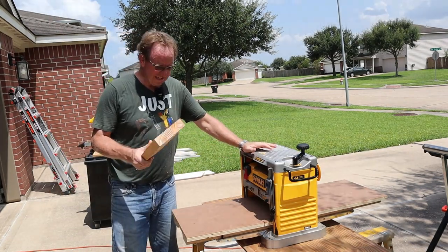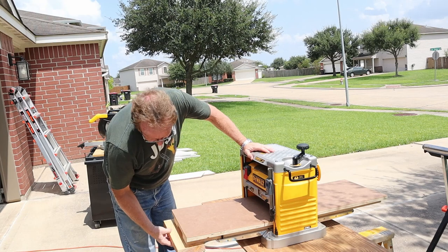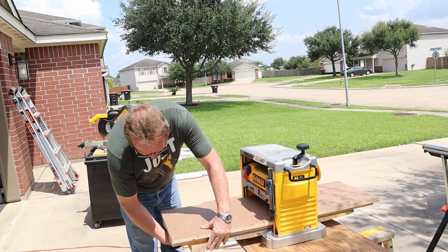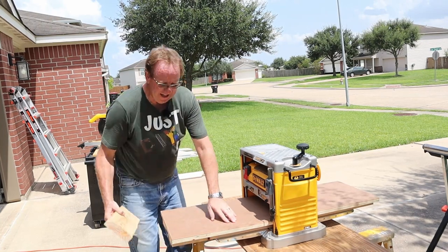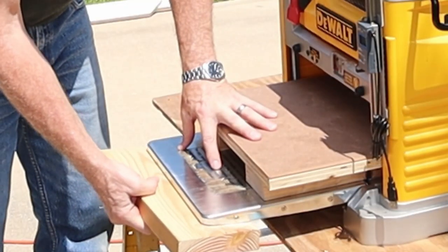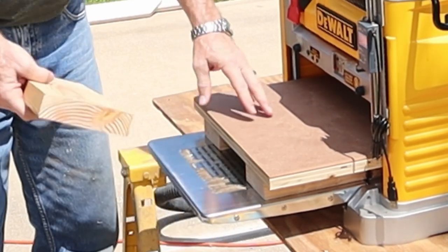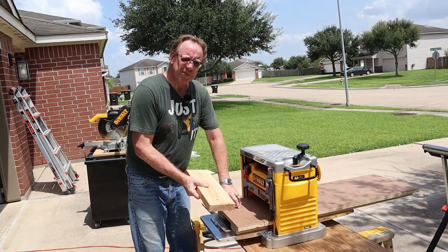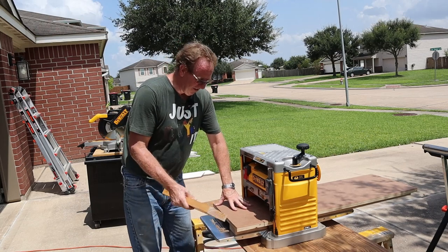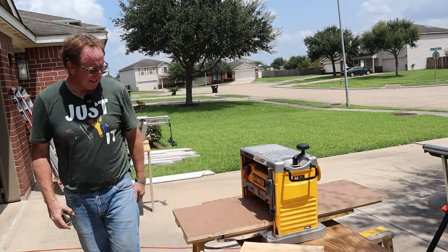How am I going to fix this? I got a 2x6 and I'm going to rip it in half. Basically I'm going to attach it to the 2x4 runners at the distance I want this to stick out. Then I'm going to custom cut a groove so that it fits over and locks in there. On the other side I'm going to lock it in and put the other stop block on the other end so it locks it back and forth. But to get it out, this will need to tip. I wanted six inches sticking out this way and the rest the other way.